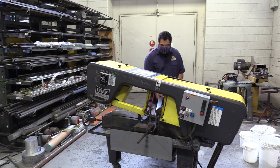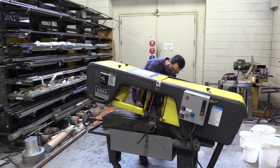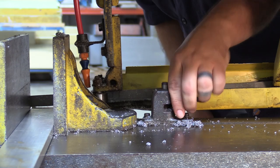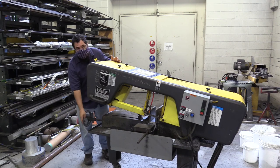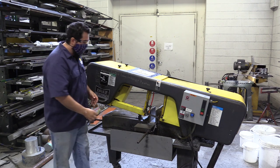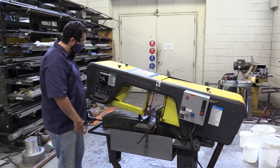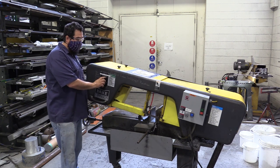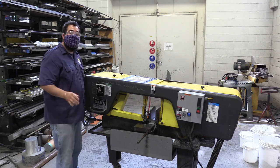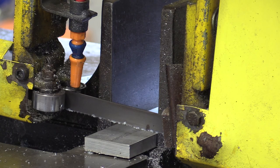I have it up. I'm going to take my material, come around back, and push it through the vise. I can take this little handle to open and slide the vise open or closed. I want to get it closed and lock it back in place — this handle will tighten it so it won't move while we're cutting. Right now I need it loose so I can line up with the line; I'll bring this down slowly and get as close as I can without touching the material.